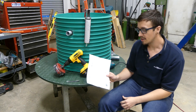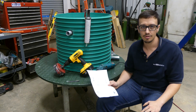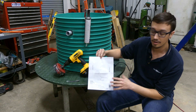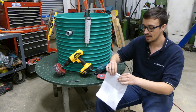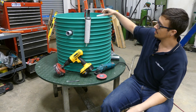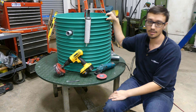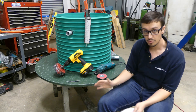Inside the splice box it comes with a few parts as well as instructions, so I recommend you read those and refresh yourself on the proper installation method. Inside there's a guide you can use to determine where exactly you're going to put your holes. Fold along the dotted line, then use this guide inside the riser and mark with a sharpie where you're going to be drilling those holes — that's where the quarter-inch drill bit comes into play. We're going to drill a couple of quarter-inch pilot holes before we come at it with the hole saw.